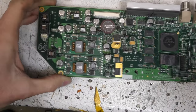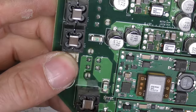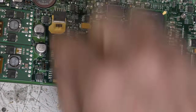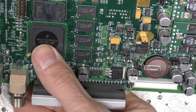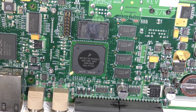It's a pretty packed board — they've crammed pretty much everything onto here. Power comes in through RF filters with ferrite beads and capacitors, a couple of fuses, and a bunch of DC-DC converter modules generating all the various internal supplies. There's a real-time clock battery, some linear regulators, and links to disconnect the output for testing and debugging. The main processor is a Freescale MPC8315 running at 266 MHz. This is running Linux. I did find a UART port but it didn't spit out anything more interesting than normal U-boot stuff, so it didn't look interesting enough to pursue further.